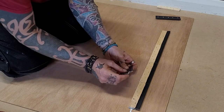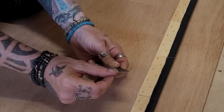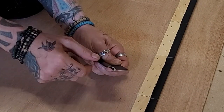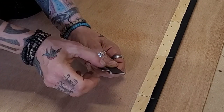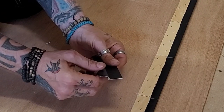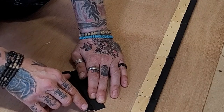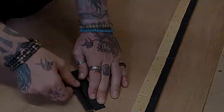And the Z bar with the rolled edge, Stairrods have actually designed it with a groove running along the fold. That allows that to basically lever over easier. If you try and pull that upwards to get the carpet underneath and down again, you can compromise that groove and you can actually snap off the roll edge. So as it's set, as long as you leave your gap to allow the carpet to tuck underneath, this shouldn't be disturbed. Once the carpet's underneath, that will literally clamp down.